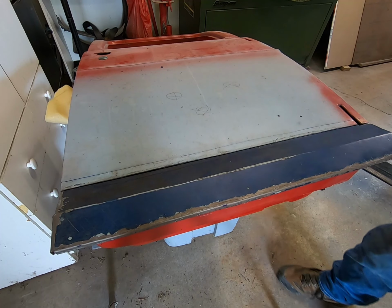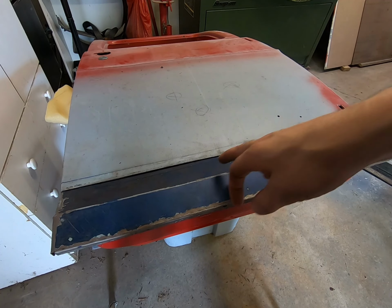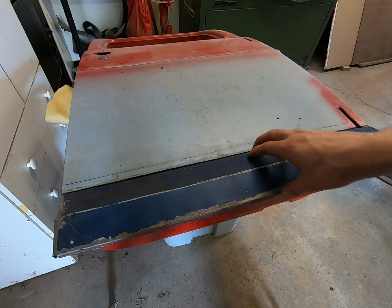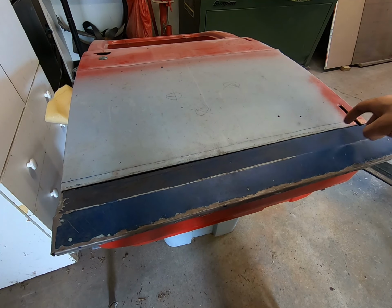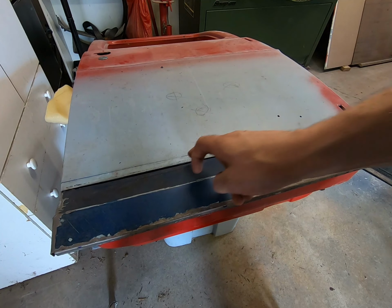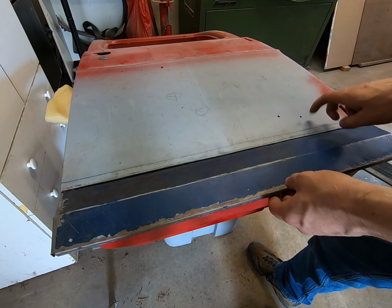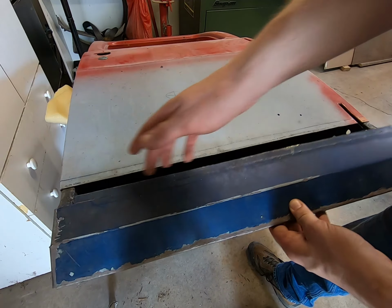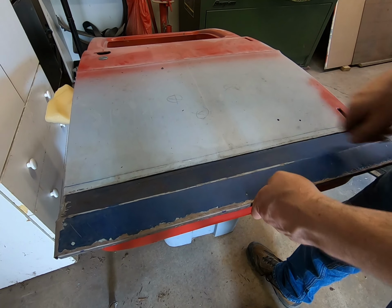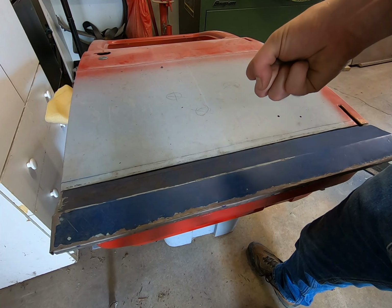And what we'll probably have to do in order to attach this and let it set, because I think I might do panel bond. I'm going to see if I have any left or any that's usable. But we could drill maybe a series of 3 to 4 holes. One starting here, here, and then two out here in the middle, evenly spaced. And that'll go through both this piece and this piece. If we put our glue on here and push it in there, it might not have enough pressure to hold them together and squeeze them tight. That's where the screws would come in and it would draw everything together.